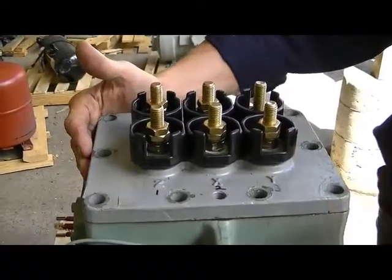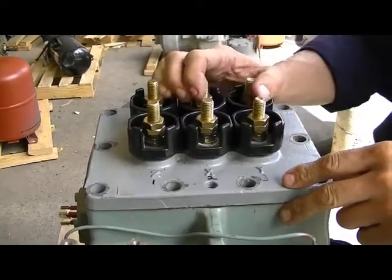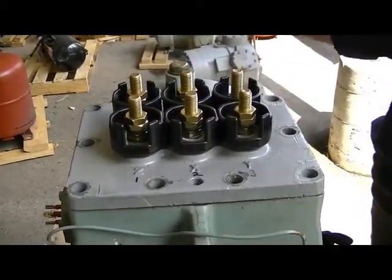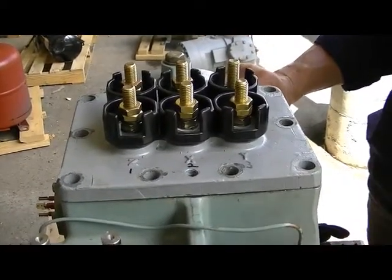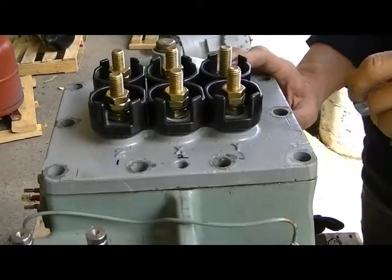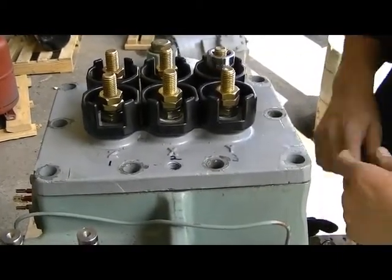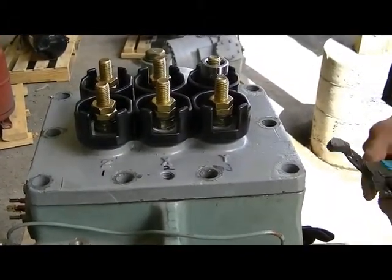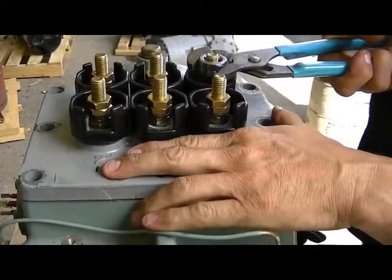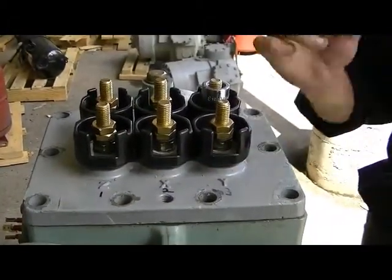To check these terminal plates, open up the main top, and if you see oil dripping down anywhere around here, you'll find that one of these is dripping — normally one of the four outers. What I normally do is put the system in a vacuum, valve it off, pressurize just the compressor to about 70 pounds. Clean the oil up around the terminal, soap bubble it, and find out which terminal is leaking. Once you find the leaking terminal, take off that wire, put a socket over the top, take a pair of channel locks, and watch that stud to make sure it isn't spinning. Most of the time you can turn it about a half a turn until you don't see any soap bubbles anymore, and that will stop your leak.